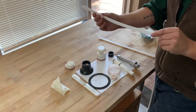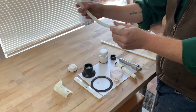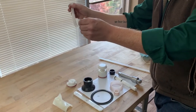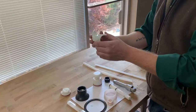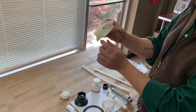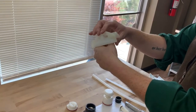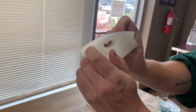In general, for a Taylor blade, when you have it wrapped around the auger and you put it inside the barrel, it needs to have some resistance. If it just flows in really easily, that means there's no resistance. You want to feel some resistance as the auger and blade are going in, and you want to make sure there are no large marks. The Stoelting model actually has a wear line that tells you when you need to replace it. Right here, a little spring attaches a set of these blades. You can even see the wear line written maybe right there. You might not be able to see it, but if you see one up close, you'll know.